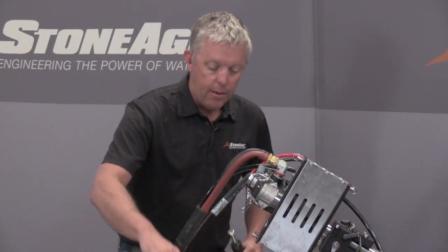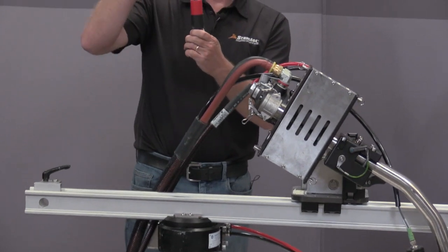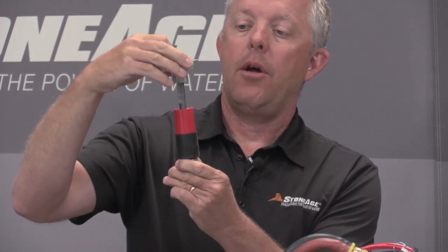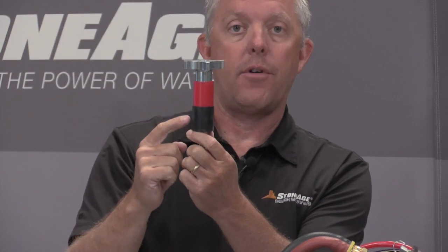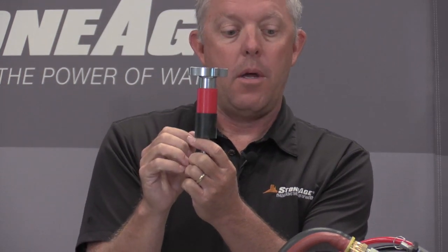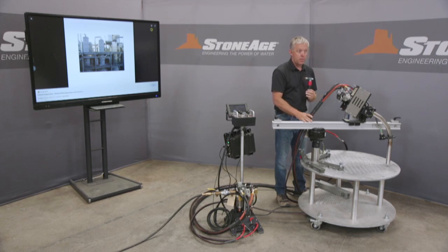And so we can move the legs, and to attach the spider plate, we have this. This is an expansion plug setup. Common terminology in the US would be called a plumber's plug. And so as I rotate the handle here, it compresses a hard plastic against a softer durometer plastic. This will expand inside the tube, and that's what holds our spider plate in place. This is really important to know that this demonstrated here, I'm in a vertical situation, but this is very applicable for horizontal applications also.